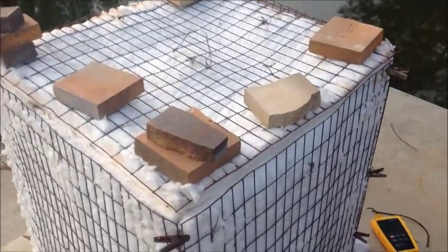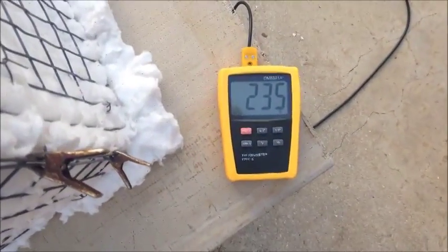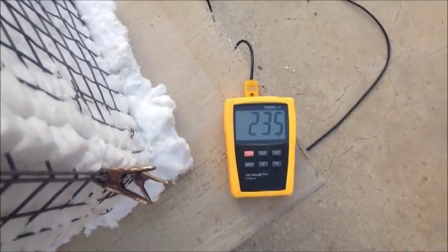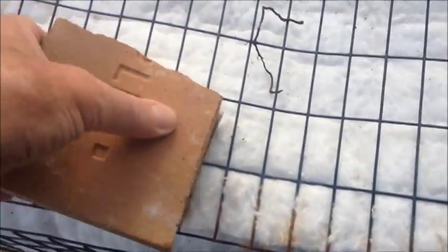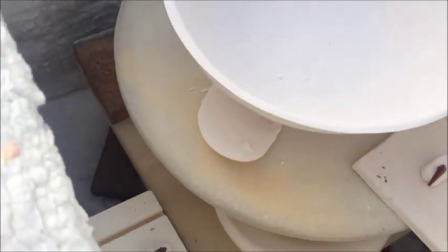It's almost 8 o'clock in the morning, so this thing has been cooling for 11 hours and we're still at 235 degrees. I'm going to go ahead and crack the lid though — we're below the 400-degree cristobalite formation area, so it's safe to open the lid and let it cool off a little bit. Looks like I do have a problem on this top pot — not good to see. I'll unload fully later.